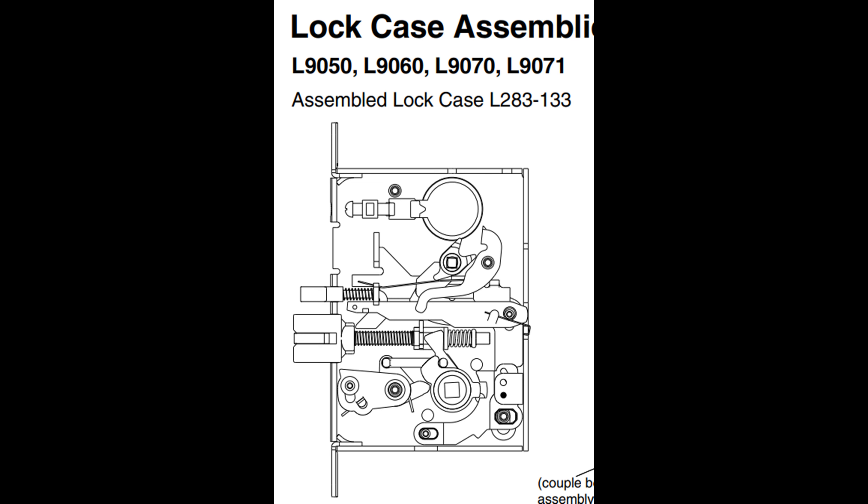The CTZ-34 is the cam — that's the proper cam for Schlage. So the part number is 100-200. That's going to be the permanent mortise cylinder for that door. On those 100-200s, you're never going to see those. The owner's going to hold on to them, and someone's going to go in and install them after you guys are out of there.